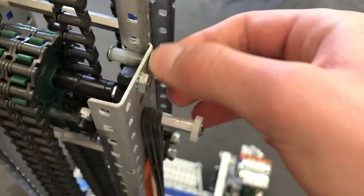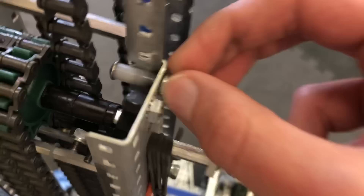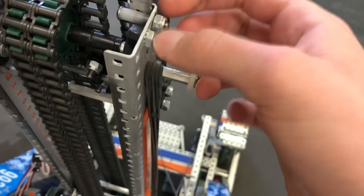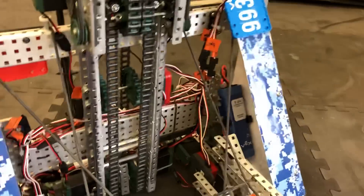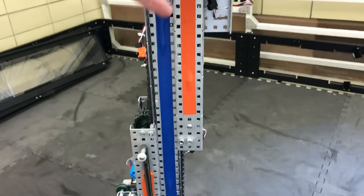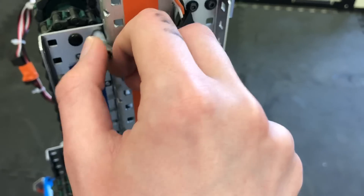When linking the c-channels, we held them in using a special spacer — this one right here. We laser-cut ours, but you can also buy these; it's legal. They are the same thickness as regular spacers but have a smaller radius so they fit nicely in there and allow the metal to slide right through them. At the bottom, because the four-bar is up at the top, you feel torque pushing inward and pulling outward in this direction, so this lower connection actually holds a lot of weight.